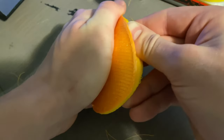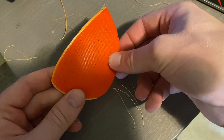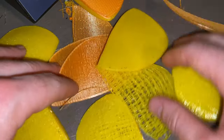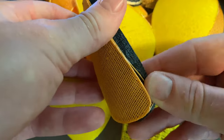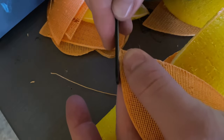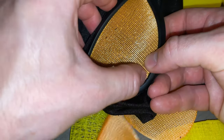The issue was inserting the lens into the frame — the shape wasn't quite right, partly due to the iPhone 11 3D scanner's accuracy. After many iterations of updating the shape, printing, and trying to fit it into the frame, I offset the boundary to add area on all sides, printed that larger shape, then trimmed it based on the lens that already fits. Eventually I found a geometry that worked, and after finishing and trimming, the first 3D printed lens sat snug in my mask. Flipping the geometry gave me the second lens — a fully complete mask with shining orange eyes.